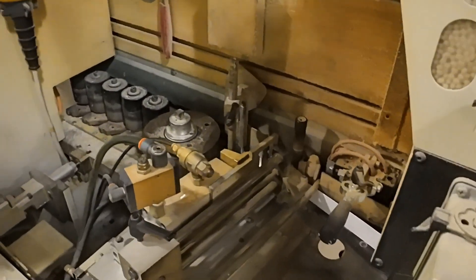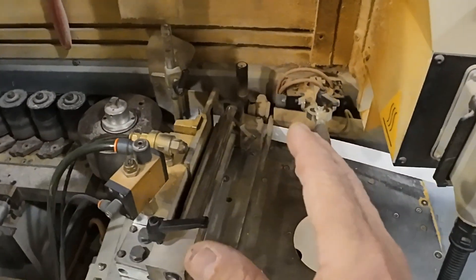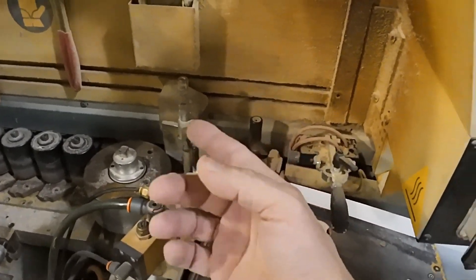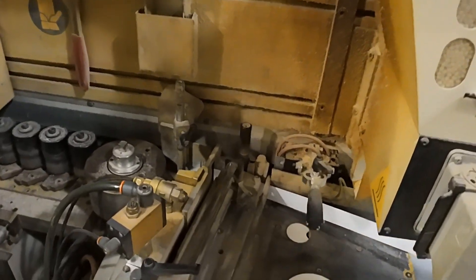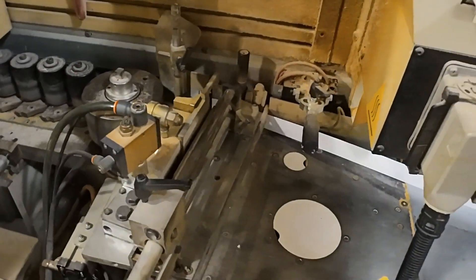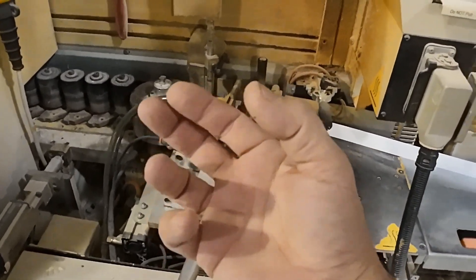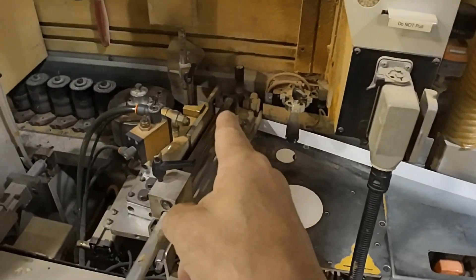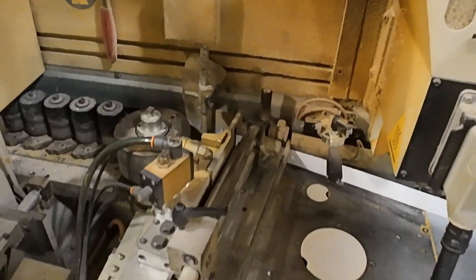We're going through and making sure that the side presser magazine is correct. There are a number of times when people will complain that the overhang on the front or tail of the part is wrong and we can go into the computer and modify the parameters to make sure those are correct. But what we want to do is avoid that if we can, because a lot of times the problem is mechanical and it shows up periodically as the machines age and as the pneumatics change. People will immediately want to go up and monkey around in the parameters when their problem is actually mechanical. If you don't fix the mechanical problem, the parameter solution is only a temporary fix and then you start adding extra complexity to your problem.